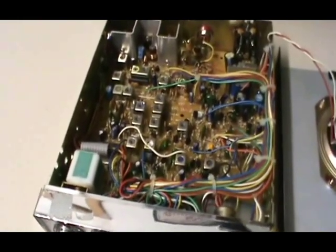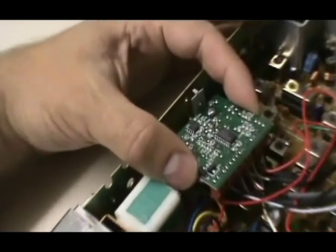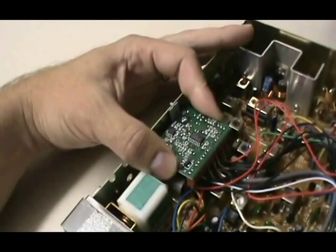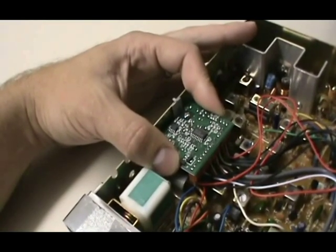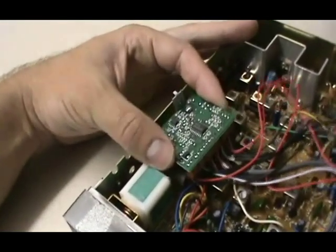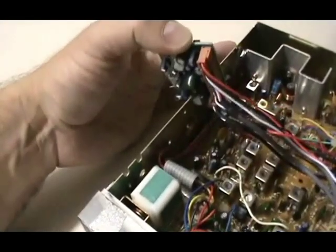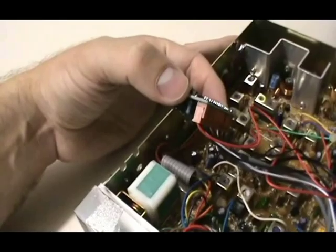We need to pick the location for our echo board. We've chosen this side of the radio and drilled a small hole just above our thumb screw hole location. We're going to mount the echo board upside down in that format. We've checked the clearance to make sure none of the components on the echo board will touch any components on the radio — that's very important. We've also verified clearance won't hit the speaker or the radio cases, ensuring nothing will short out.